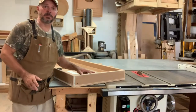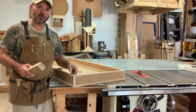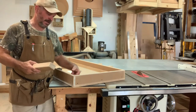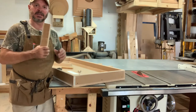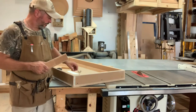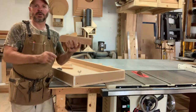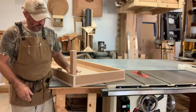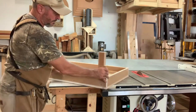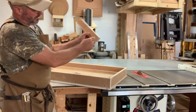On to the two-by-four for the legs. My sides overall are four inches, so the side pieces I cut are three and a quarter because I have a three-quarter-inch top and a one-inch block inside. To make the legs fold flat I needed a two-and-a-quarter thick piece, so I ripped down some two-by-fours. I came up with a little template to trace the radius onto the leg, and I'll drill these out, mounting each about three-quarters of an inch off the end using a spacer.